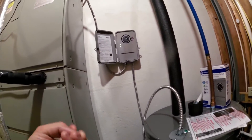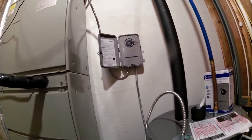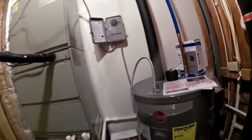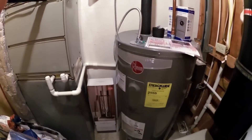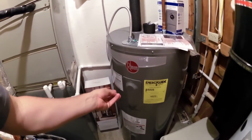At that point, if there wasn't a lot of loads in the house, the solar would only power what was needed to keep the batteries full. So we're using that extra PV that we wouldn't necessarily use — kind of like a dump load, but not necessarily a dump load. So at about 2 o'clock, I have the timer come on and it kicks this water heater on and heats the water.